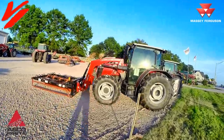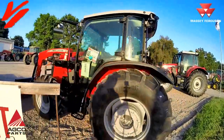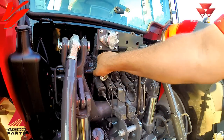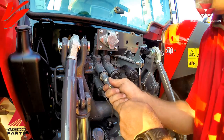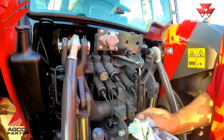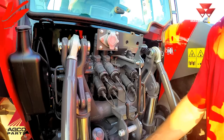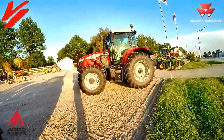Now we're up at the 4700 Global Series — our large heavyweight, large chassis utility tractors. You'll see we've got hydraulic assist couplers here. This style doesn't have a sliding sleeve on it. You push in, it hooks with a pop, and it comes back out. That is the difference between a sliding collar and a hydraulic assist coupler — the design helps hook the coupler even under pressure, especially on a hot day in July when a black hose can create a lot of pressure.